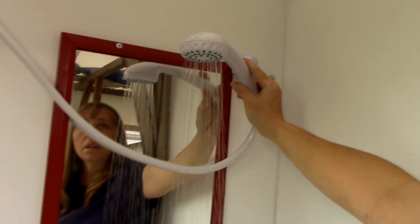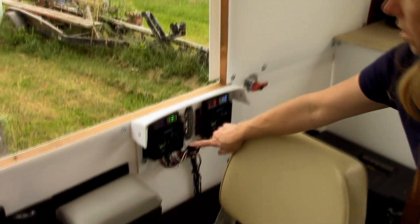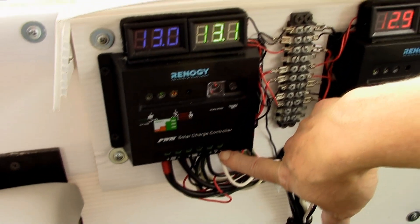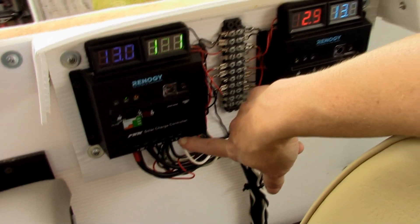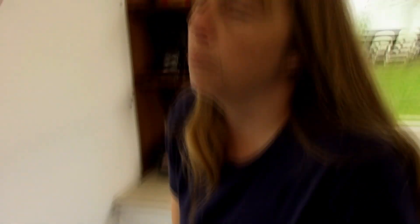When you flip the switch the other way it pumps out the shower water, and you have five gallons of hot water — should be enough to get a good shower, and even enough to wash all my hair, and I have a lot of hair. We're using shunted power to power the water heater element, hooked in right here on the charge controller. That takes all the extra power from the solar panels and from the motor once the battery is charged, so we'll only have hot water during the day when the sun is up and when we're running the boat.